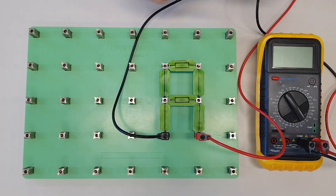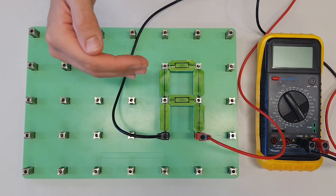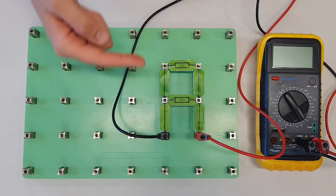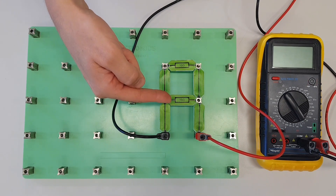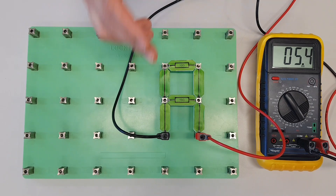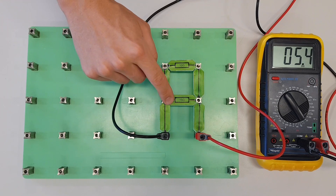Based on what we've already done: we've got two 10 ohm resistors connected in parallel, so immediately we know the total resistance is going to be smaller than either one of these — less than 10 ohms. We can also calculate it more accurately: the total resistance will be half of one of the resistors, so 10 divided by 2 gives us 5 ohms. If we turn the meter on now, we should find a 5 ohm total resistance here. And that's great — we're slightly over 5, but well within the tolerances of these resistors. So we can see clearly: two resistors of the same value connected in parallel gives us half of one of the resistor values.